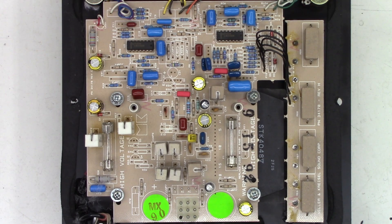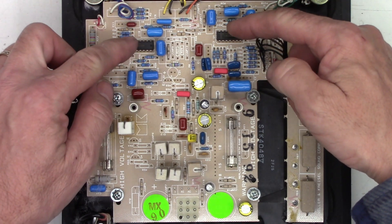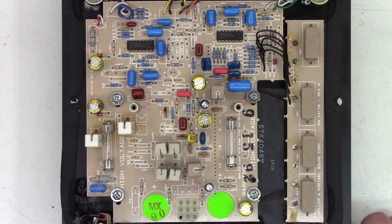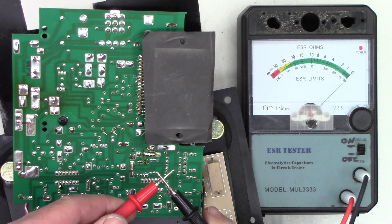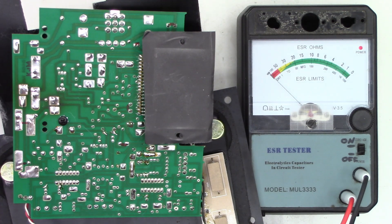There's one more right there — seven capacitors total. So I'll try to get this board up and out and do a quick ESR check on these capacitors. Because if these op amps don't get good smooth voltage, it's possible to have distortion or just intermittent noise on those lines because of a noisy power supply. I've got the board flipped up here, got my ESR meter out and verified lead integrity is good — right at zero ohms. Perfect.